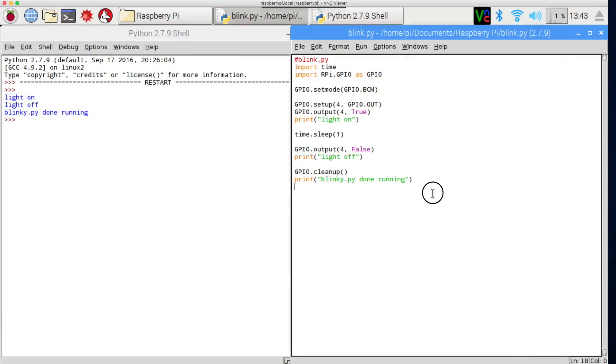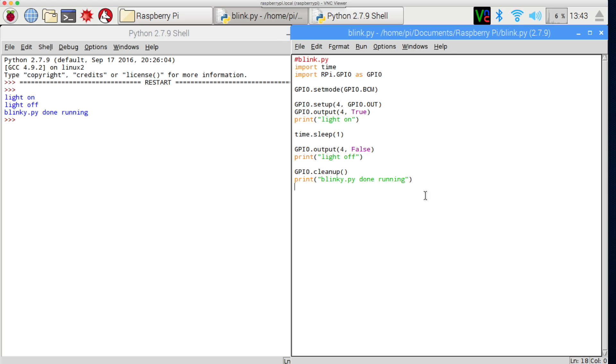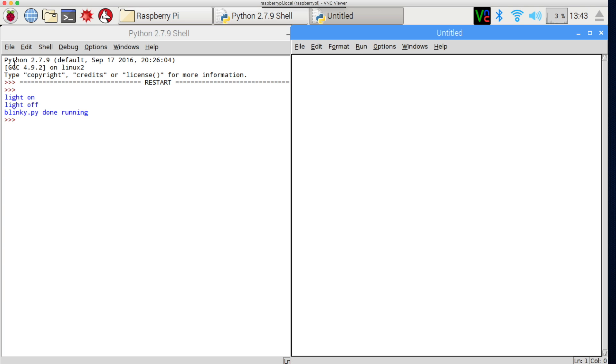Let's put power on and start coding. I'm going to create a whole new file — I'll close this down, new file — and I'm going to call it button input. We know right away we want to import RPi.GPIO and refer to it as GPIO in our code. I'll still need sleep for a timer, but this time I'm going to import it a little differently — last time we imported the time module and called time.sleep.